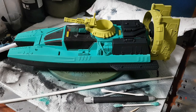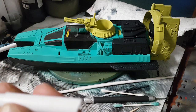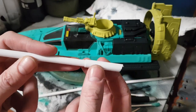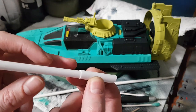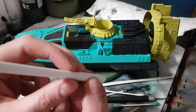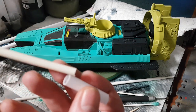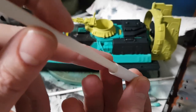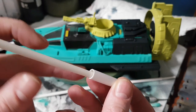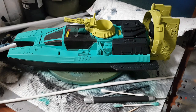When fitting the tubes inside of each other, don't go too far out or you'll have a flat end again. I like having a good amount inserted because you want to give it some strength — the closer you are to the edge, the more likely it is to bend. Size your tubes so there are no gaps between sections. If there's a gap, you can't keep the inner tube centered, and those air gaps don't look like a real deal. Make sure the tubes are snug inside each other.